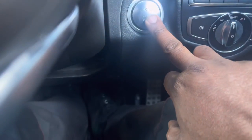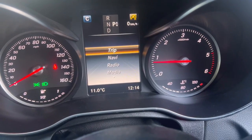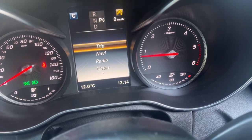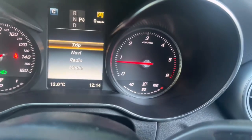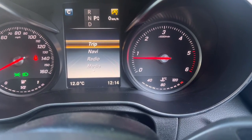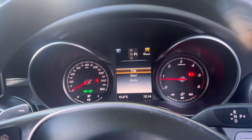Press the brake pedal and start the car. You can see all lights have disappeared — the orange and red ones are gone. That means we've done a successful job. After that, you have to press and release the parking brake a couple of times. Press — see the light activate. Release — light's gone. Press again — it's on. This is the correct procedure for working in shop mode.